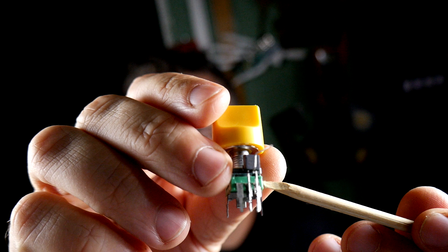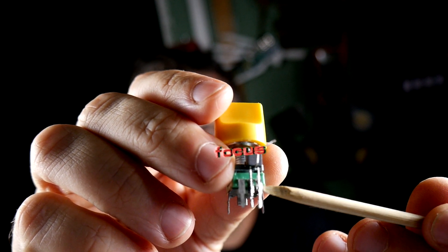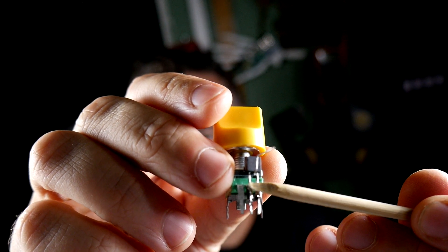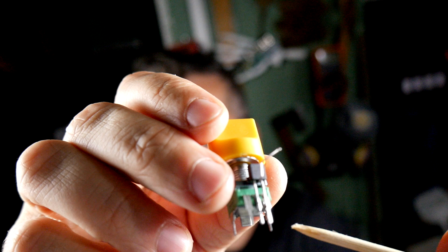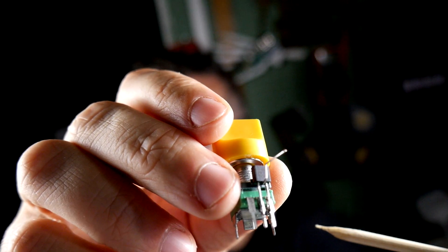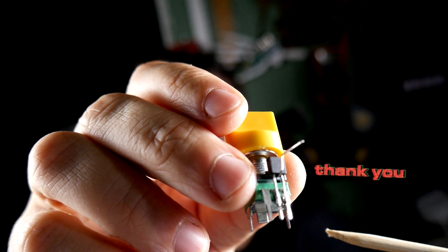The voltage from the power pin to the gate — or the wiper of the potentiometer — sets the scale. So if you're sending a five-volt signal to an Arduino or a regular Eurorack module, aside from the dropout at the bottom, they will scale directly. If you're sending it to a 3.3-volt digital circuit, you'll want to scale your input with a voltage divider — just two resistors that allow only two-thirds of the voltage in — and then it'll scale normally. Another con is that the signal has to be unipolar; you can't go into negative voltage with this. You can get a 10-volt swing if you want, but you'll have to build additional circuitry to make that work.